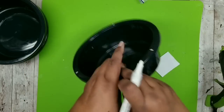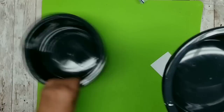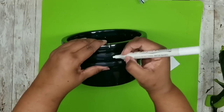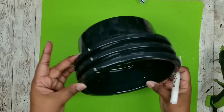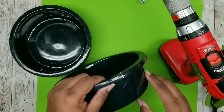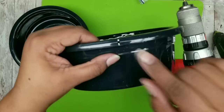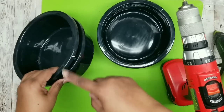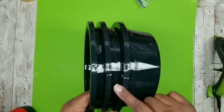I'm also going to mark the side of the bowl. To make sure all other bowls are marked exactly the same way, just stack them all together and transfer that marking to the side of the other two bowls. Now everything is marked and ready to go. I'm going to drill a hole in each side of the bowl - I only want to drill it through the lip. Using a 3/32-inch drill bit, carefully drill it through only the lip of the bowl, not going to the inside. Repeat this for all three bowls and here they all are with pilot holes drilled into the lip on each of the three sides.